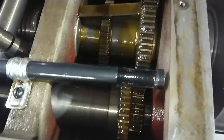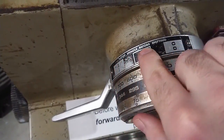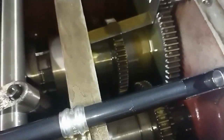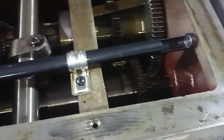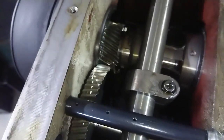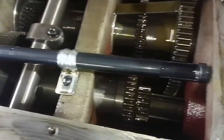That's what gives you your speed reduction option. Now the reason why you stop spinning before shifting with the range selector — let's look at what just happens: I turn that gear the other way to move to the next power range, and things don't mesh really well. Sometimes you have to spin it around to line up the gears. If you try to do that while it's moving, you end up pinning the gears. As you can see, now it's going to move a lot faster, but the speed is still coming through that second gear mechanism down the shaft and back over here to the spindle.